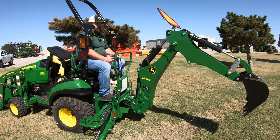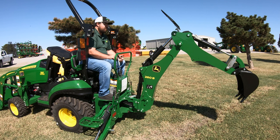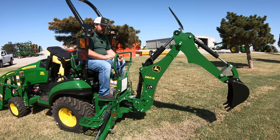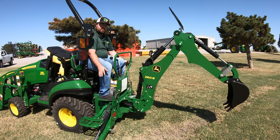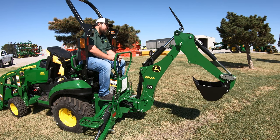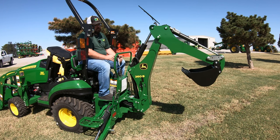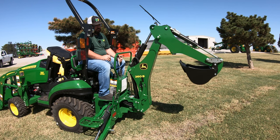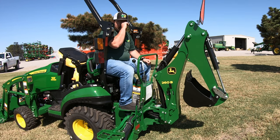All of this just takes a little bit of practice — it's fairly simple. The main things we have to make sure of when operating one of these backhoes is making sure the safeties are released before we try to open anything up, and making sure our stabilizers and tractor are in a very good and steady spot before we actually use the machine. Get everything back in line to where we are all ready to lock this thing up, and just like that, you're good to go.